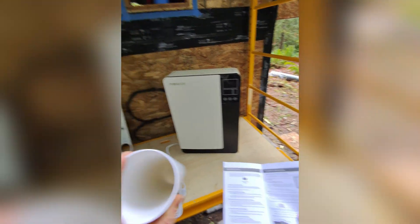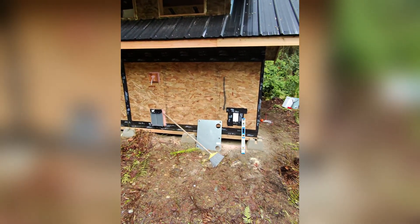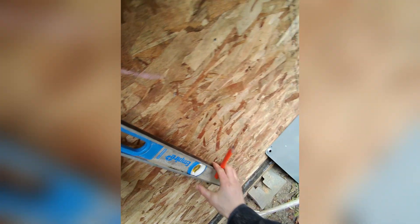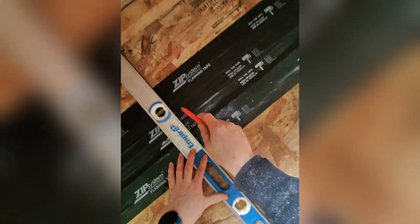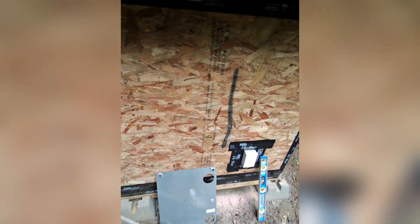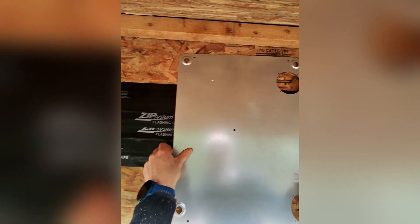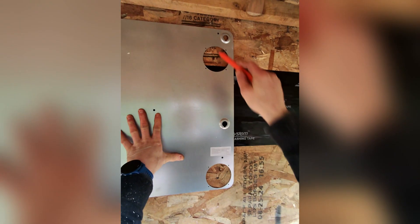The floor space of this building is twelve feet one way and eight feet the other way. I want the ERV installed in the first four feet, so I've marked out four feet here with a mark and one up above, then used a level. Somewhere in this area on this side is where I want to put it. If I go too high, the outlets or inlet will come up against the inside of the roofing, so I want to give it a little bit of space. I also need to check whether the outlets will be on the right or left side.